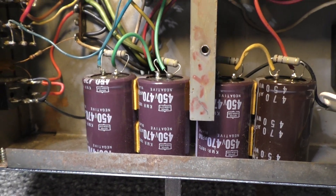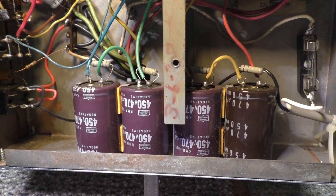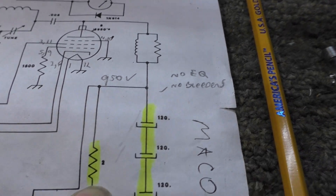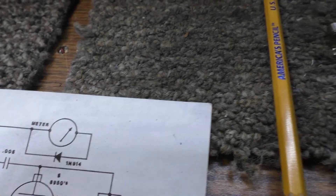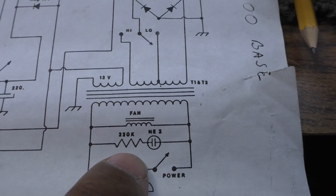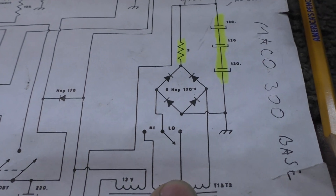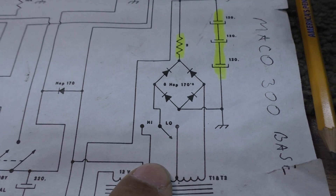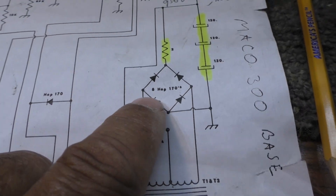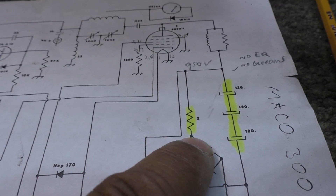Even though 470 UF is kind of overkill, it's going to be a heck of a surge when you turn it on — it's going to dim the lights. Even though this amp does have a surge resistor in line, which is this 2-ohm, I believe 10-watt resistor right here — that resistor coming out of the diodes on the high voltage. The high voltage: your 120 comes in on the low voltage side of the transformer, this is the high voltage going out. It has a low voltage tap there, which we'll talk about pretty soon because that's the problem with this amp — one of the problems the rebuilder ran into. The high voltage comes across the 2-ohm, those are your reds, and they go into the bridge rectifier. Your rectified AC comes into that resistor — that's your surge resistor.